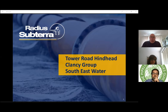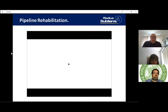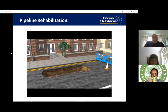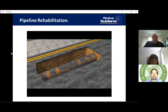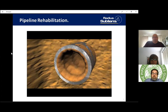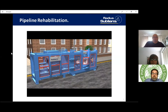The technique I'm going to talk about today is one of the techniques within the Subterra brand of pipeline rehabilitation. This technique is the roll-down technique, where we take a structural pipe and insert it through a host main as a size-for-size replacement or liner to the host main.